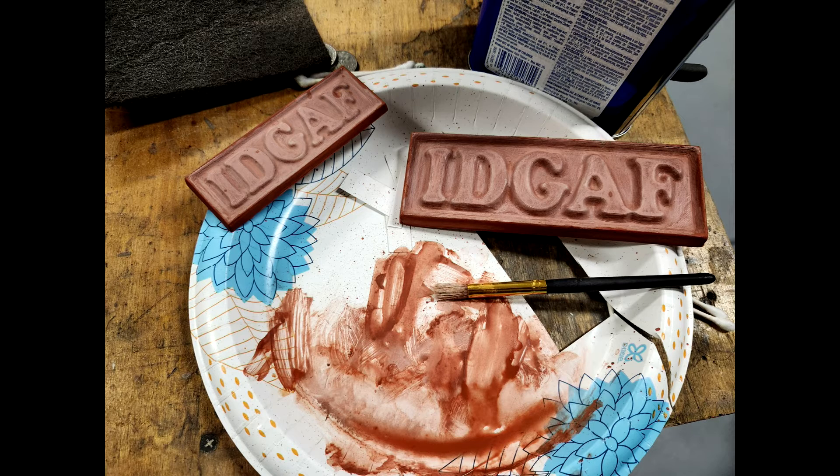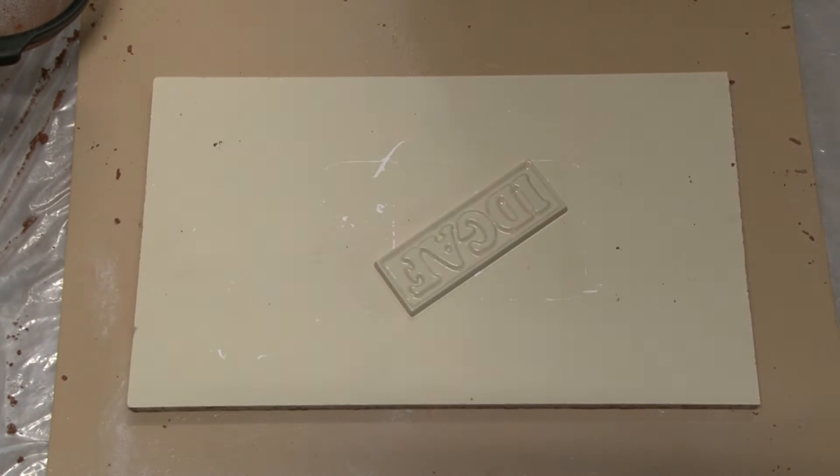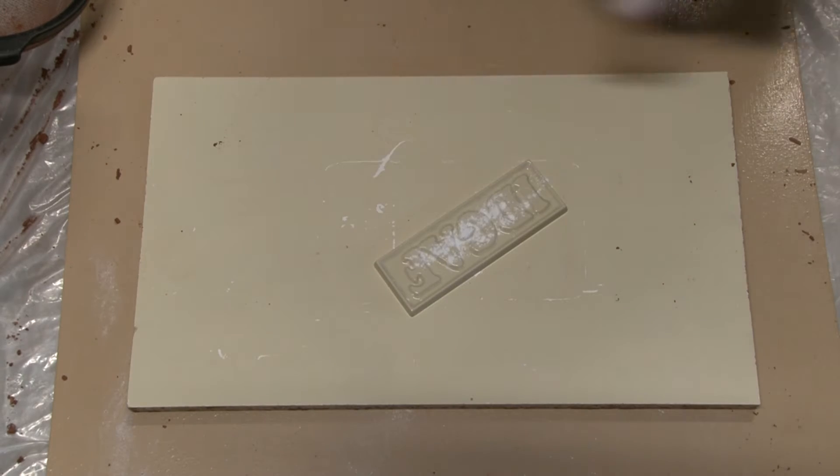This is what I was talking about at the beginning — putting a little bit of acetone and spotting putty together and just painting it on the surface of the 3D print. I can sand it, and that spotting putty sands really well so you can get fine edges and get rid of the 3D layer steps from the printer. Here's the sign again with a little bit of primer on it. I can sand this a little more and then coat the top with epoxy — the epoxy makes a really great surface that the sand doesn't want to stick to. Here's the pattern all painted with epoxy.